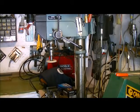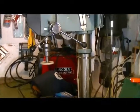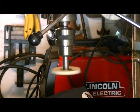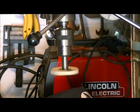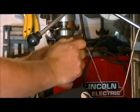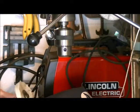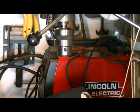Compound you want to use, and go ahead and start polishing parts up. Now the other nice advantage to this is with a drill press you get those multi-speeds, eh? Where a regular buffing machine, you usually wouldn't, unless it's a really expensive one. But with a drill press, you're going to get access to a lot of different speeds for buffing purposes.